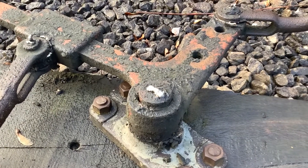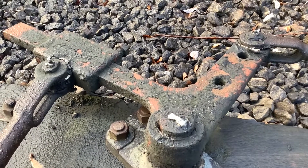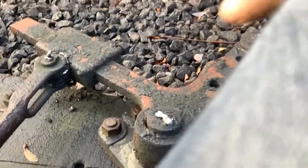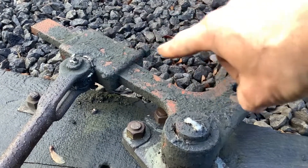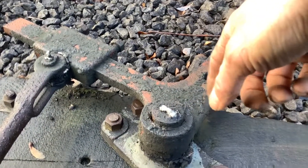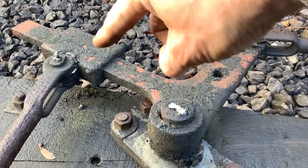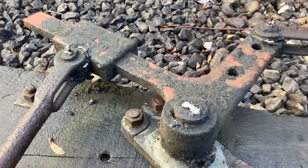We mentioned in part one of the video how to set up the drive to the points and the adjustable crank used at the end of the rodding run to reduce the stroke from roughly seven and a half inches on the lever tail down to the four and a half inches needed to move the point. This is the adjustable crank here — on the end we have our slipper with our two adjustable bolts and two locking nuts behind there, and that's used to gain or lose stroke on the crank. One thing to note: the new standard arm is slightly fatter and thicker and comes with its own slipper which is unique to it. You can't mix and match them — the old slipper won't fit the new rod — so be aware of those differences when you get recoveries.